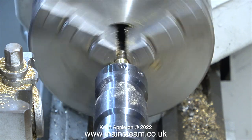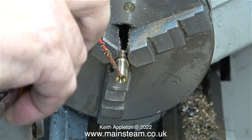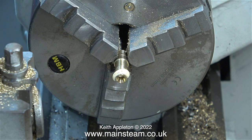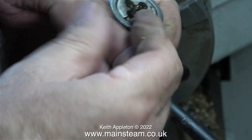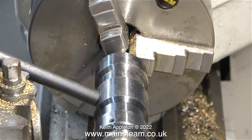It's not concentric because I can't hold much of the metal in the chuck — what was left over after I made the stud was not very long. I'm using some cutting lubricant, but it's very important not to get any of this on the metal part held in the chuck. This is an extreme pressure lubricant and it will cause the chuck to slip around the work.